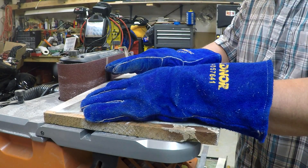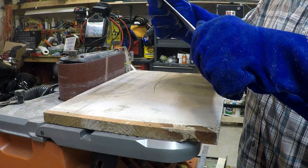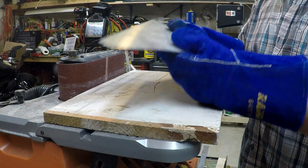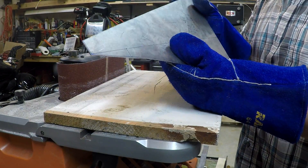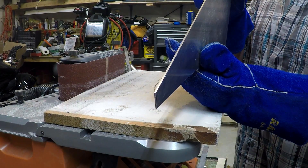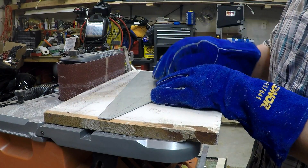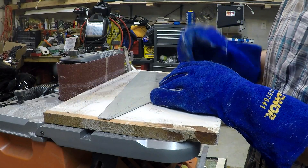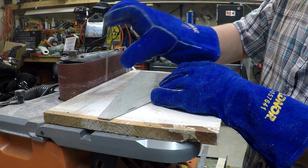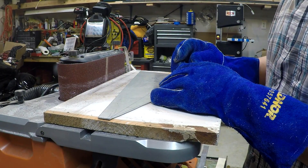I can't feel how hot this is through the gloves, just a little bit of warmth - not burning my hands and not changing the temper of the metal or anything like that. It's using a very, very narrow part of the belt to trim this piece of material. So the much more preferred method of belt sanding is when you're using smaller parts and can use the belt and disc sander combo with the belt in vertical mode, because you're using the entire width of the belt. I've got one more part to cut out and trim that way and I'll show you what I mean.